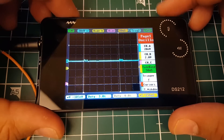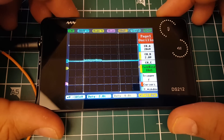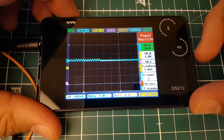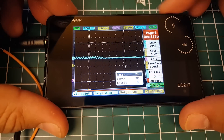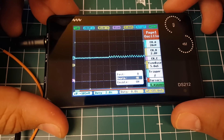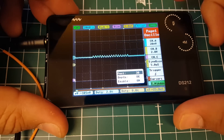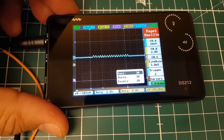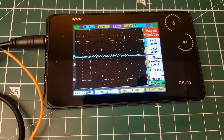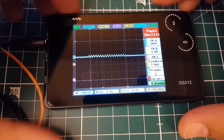It's a bit difficult to make out what it's saying here. Going to the window menu to move the signal — let's push that to get our signal right in the middle. We can drop the sample rate down, which makes it faster — keeping it at 8K for resolution. Dropping the time base back a little. Looking at the motor tab now, increasing and decreasing, but the lines are not square because this is not fast enough to catch D-shot 600. My bigger oscilloscope shows long square pulses, but here we get squiggly lines.